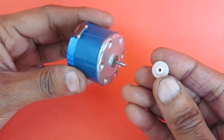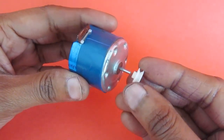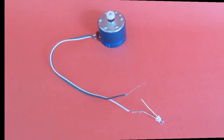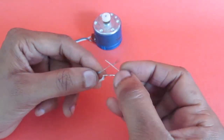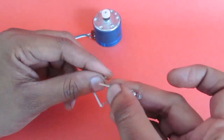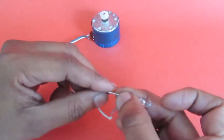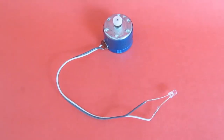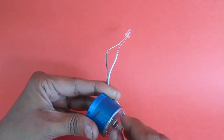This is a simple motor on which we will attach a pulley. In a regular motor, when we connect it to a battery it rotates the pulley. In the generator, we have attached a LED instead of a battery, and when we rotate the pulley it generates electricity and the LED lights up.